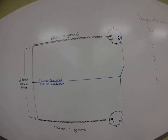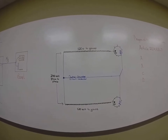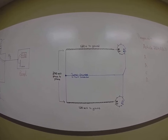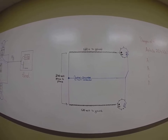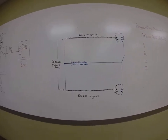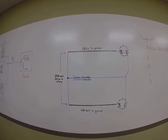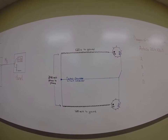In this picture, you're going to see your normal three-conductor, three-wire 120/240 volt single-phase service. And this picture is essentially a diagram of what a transformer secondary would look like. I simply connected two light bulbs to each 120 volt phase. So this picture is very simple. It's not showing the panel or the circuit breaker or any switches that would be in the house. I'm going to prove a point with this drawing in a second. And all houses have this type of service.